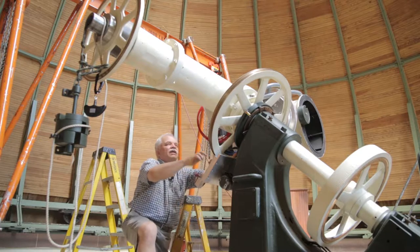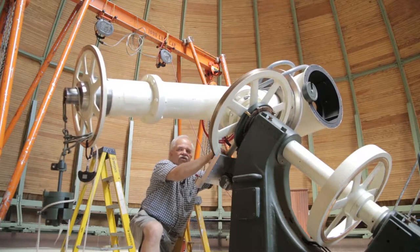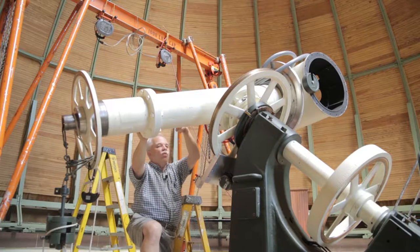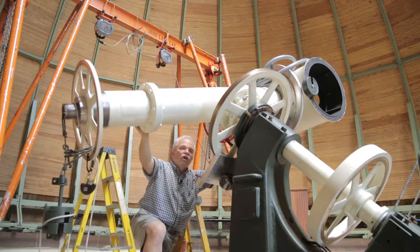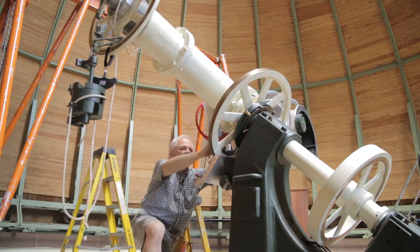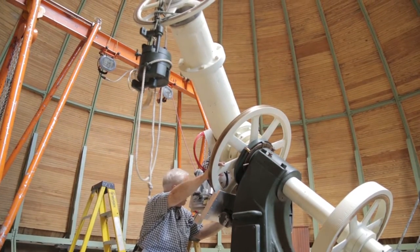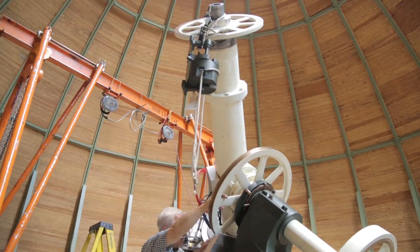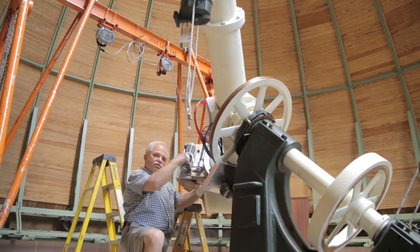Pulling this out of mesh, we can now rotate in the positive hour angle and right ascension direction much faster than a telescope would normally rotate. Here we would be looking west, as the astronomers say, with the tube east of the pier, which is the normal mode of operation. Going the other way, with the declination axle high on the west side, this would be looking east — and if we go too far east we're going to crash the axle into this drive. That's about as far as we'll be able to go looking east with the tube on the east side.